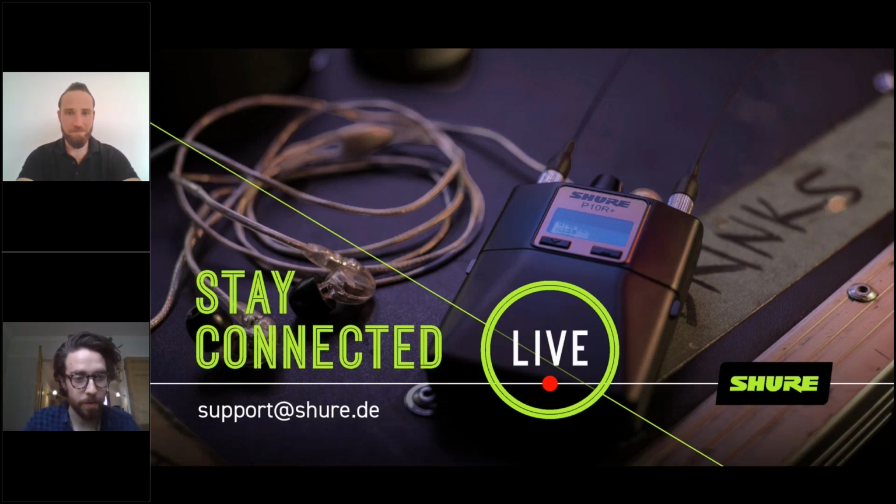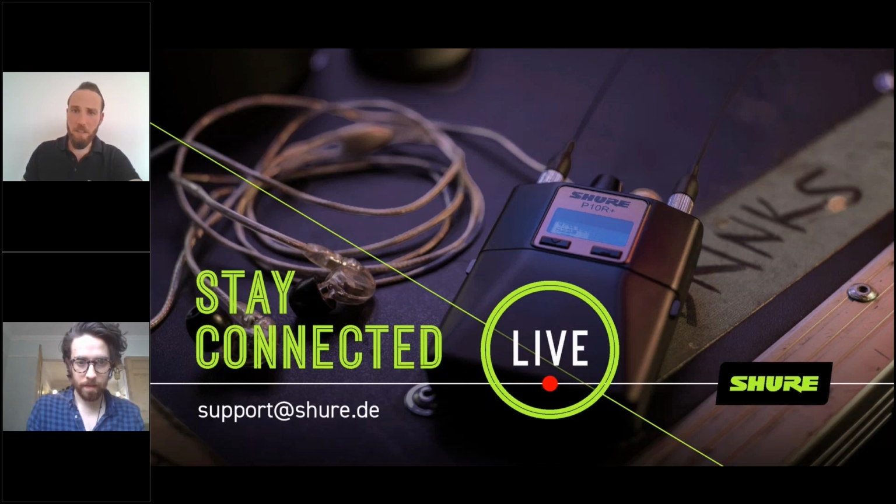I've got another good one here that's come in from Mike Crow. Mike asks, can a standard Shure UA874 antenna be used as a transmitter antenna with a combiner? Not if you have the active antenna on, no. For in-ear monitoring, you need to use passive antennas only, because otherwise you would damage the combiner or the transmitter unit when putting some power on there.